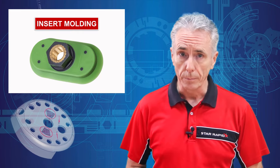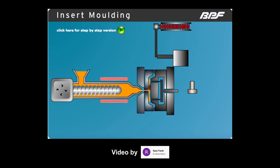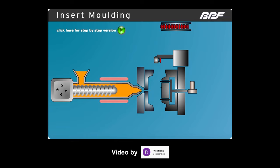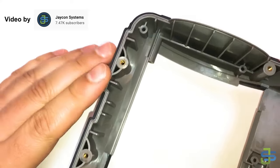What is insert molding? Insert molding means to place one component — the insert — onto a pin or other holding fixture inside of a plastic injection mold tool. When the mold closes, thermoplastic resin is then molded around the insert, permanently sealing it into place. The insert is usually a small metal or plastic piece like a threaded screw fitting or an electrical contact.